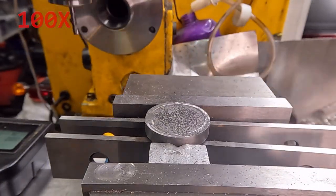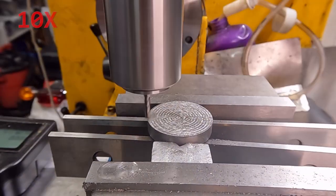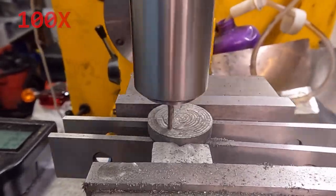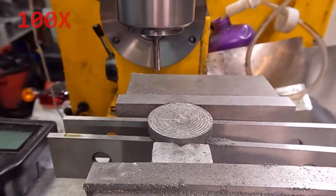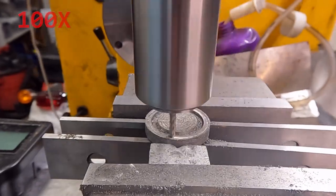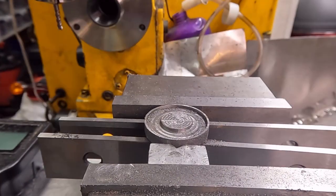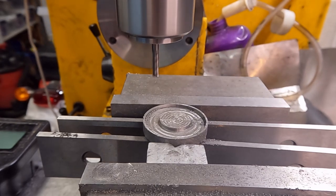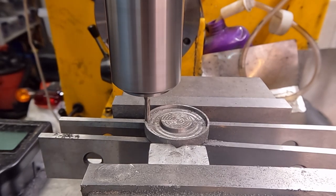We're running faster than advertised because I think it's 60 Hz instead of 50 Hz. This goes really slow — sped up partly because of the lack of rigidity and a lot because of the acme screws and the feedback loop in the CNC. I need to take these accurate cuts very slowly so that the CNC can keep up with position. Luckily with this small tool you don't want to go more than about a thou or two per rotation anyway. On a real CNC machine you'd be running this bit at like 18,000 RPM and chewing through the material a lot quicker.